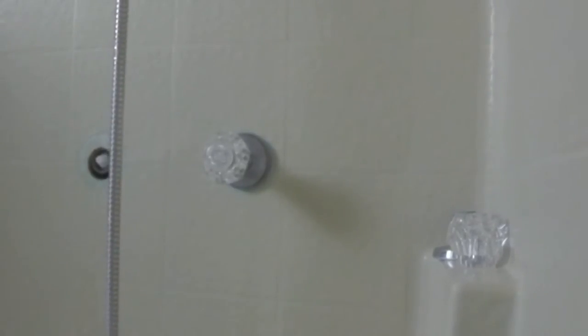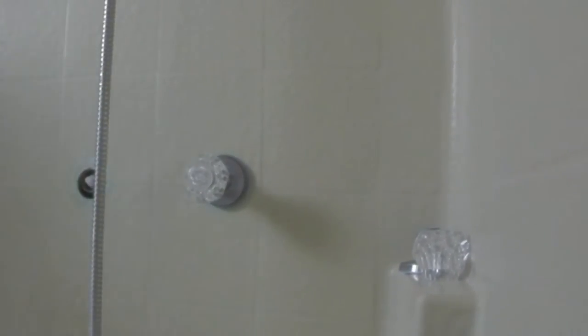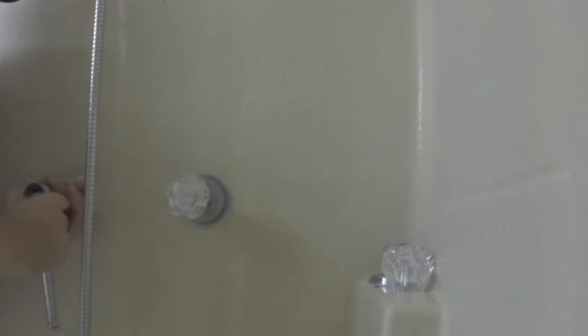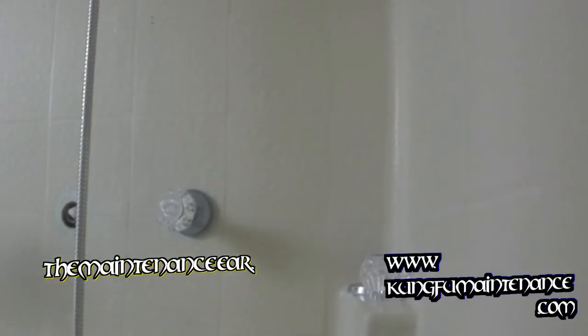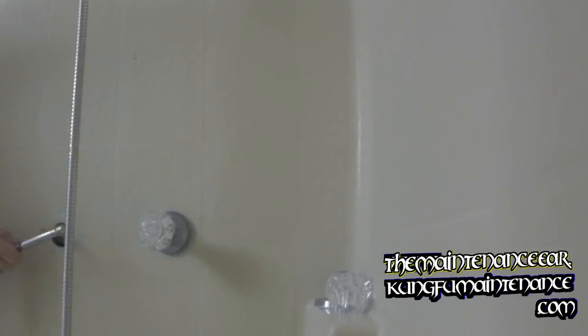There's a drop off. What I'll do is open the line just a tiny bit and then tighten the cartridge down another hair and we'll turn it off. You may be wondering why I tapped it there — the new cartridge uses a system of O-rings that rotate inside, and my thought was just bumping it a little bit might make it work out.